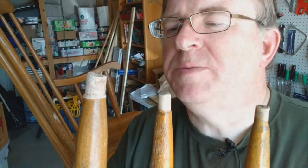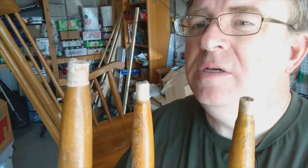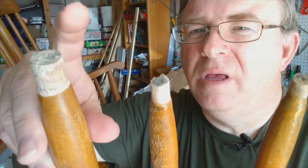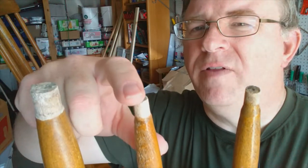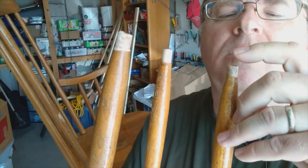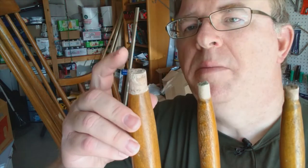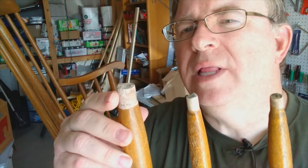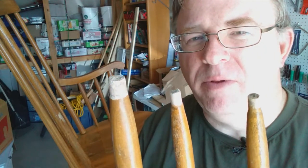Let me show you what I found on first inspection. On the spindles, they've all been glued. These two spindles, particularly the ends, look like they've been previously broken — they're not flat on the end. This one is flatter. It's covered in old glue, so I'm going to do a light sanding. I don't want to alter the shape of the spindle, so I'm going to try to be really careful about that.